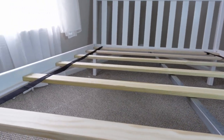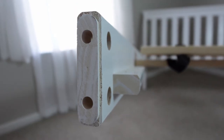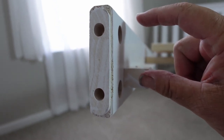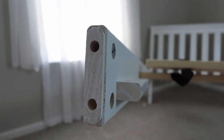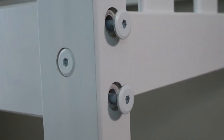Tip seven — all the side rails are exactly the same, but it is easy to accidentally mount them upside down. Mounting the side rails upside down will cause problems when mounting mattress slats and safety rails later on. You need to position the side rails with the ledge to the inside of the bed, and the wider section of the side rail will be upward. Then you can fit them into the recess in the headboard. Slide the barrel nut into the hole in the side rail with the slotted side showing, then thread the long screws in from the outside of the legs.